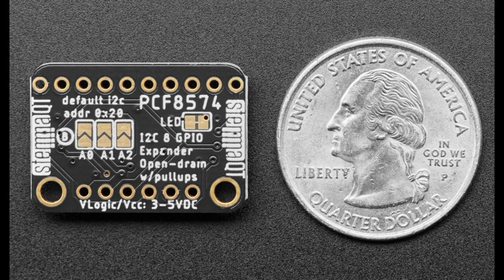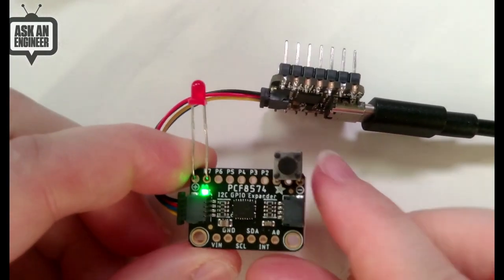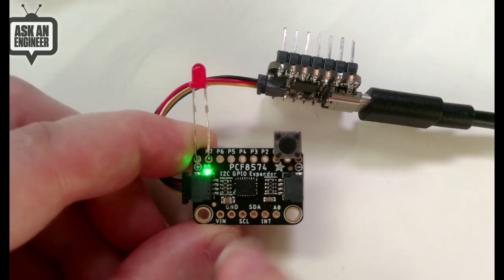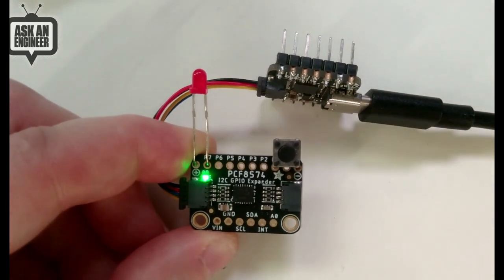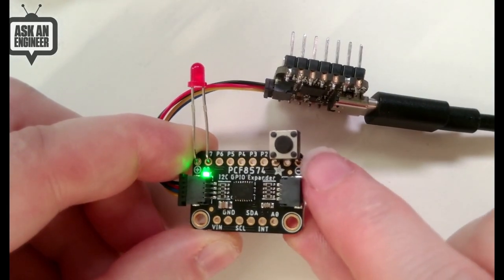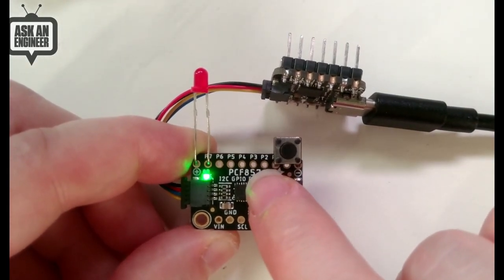If you want it to be an input, you turn it on with that weak pull-up, and by default it reads high, and if whatever signal is sent low, you read low. And if it's floating, it reads high. So if you have a button, for example, I'll show this on the overhead. I have 2 IOs here, because this is actually the most confusing part, buttons and LEDs. Note that I didn't have a resistor with the LED, because I'm being cheap and fast here. So the button goes between ground and IO number 1.